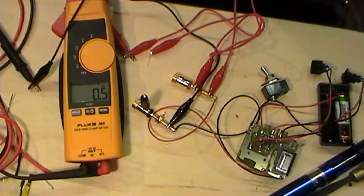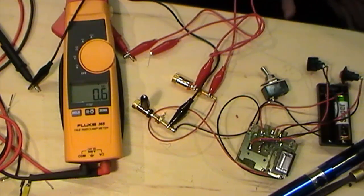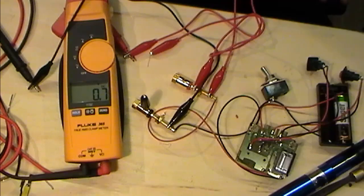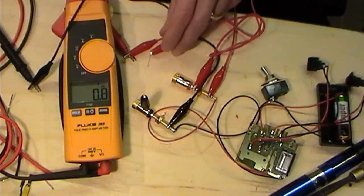Okay. One thing to point out is, obviously I've had, if you like, a discharge switch to test the flash, purely to test that this circuit was working. Because I've come directly off the cap now and I'm getting my short directly off the capacitor, there is no need whatsoever to have that switch there. That was purely to test. So that switch can now be removed. No need to discharge it, because we are effectively just discharging the cap straight when we short.